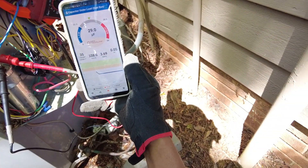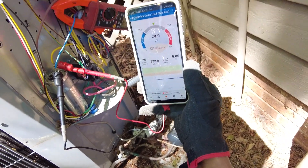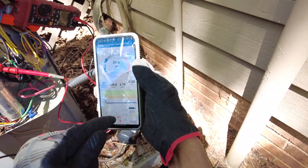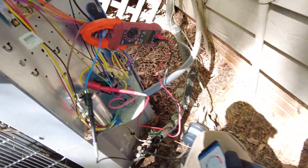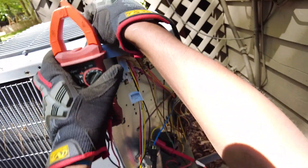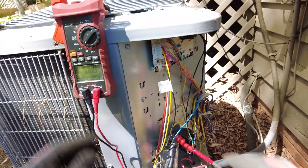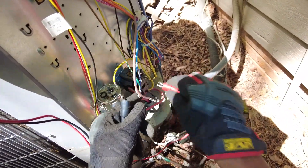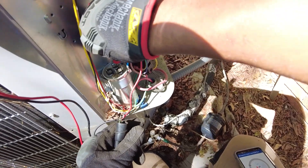I always like to do a quality check. So what I'm going to do is cut the system off and see how close this actually was. I'm going to take a screenshot here. And now we're going to just go to capacitance, and take off hermetic blue, fan brown, and yellow. It's going straight to the contactor — that's going to be our common. Let's see how close this thing was.